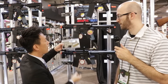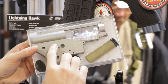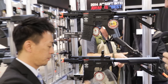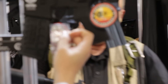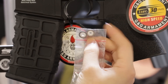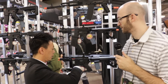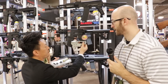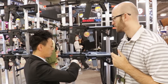This is the gearbox on my hand right here — that's a sample of the gearbox. The gearbox case will be proprietary because we have — let me just show this — ceramic bushings with a metal cover. The ceramic bushings are 8mm, so that's proprietary. In order to have the 8mm ceramic bushings, we have enlarged the hole on the gearbox, so that's proprietary as well.